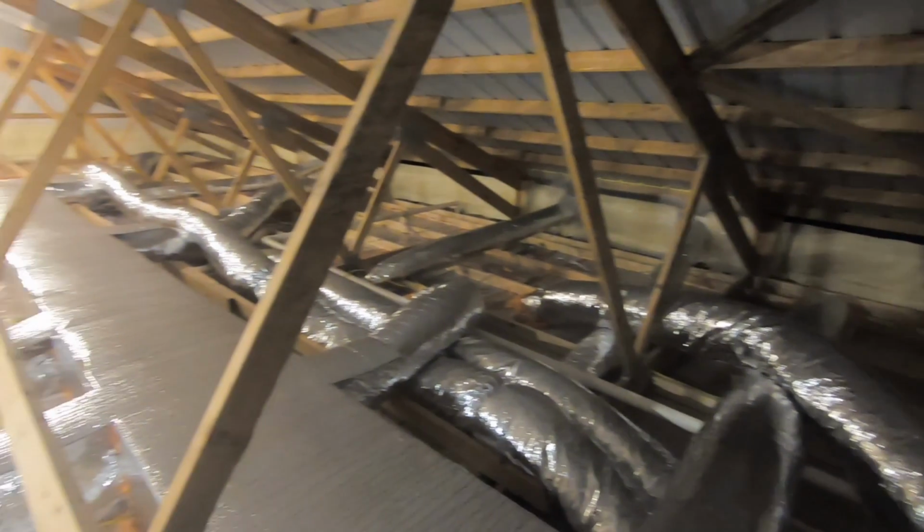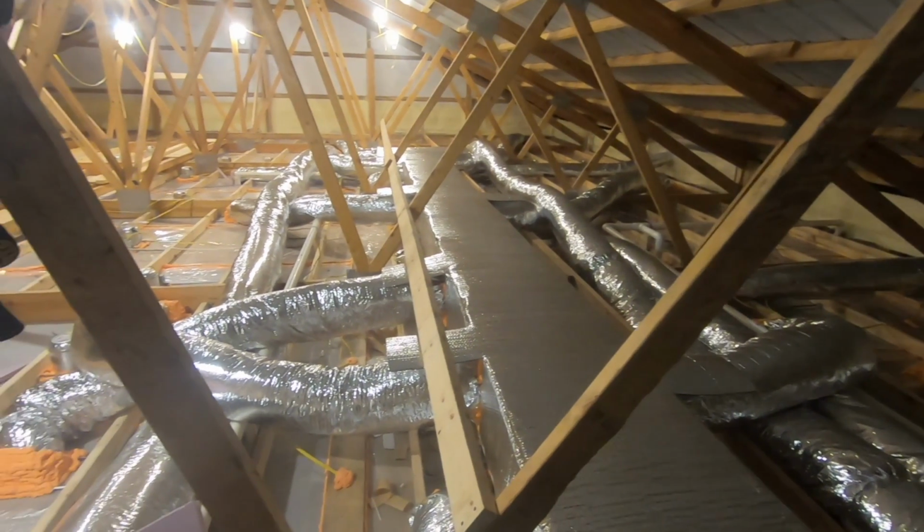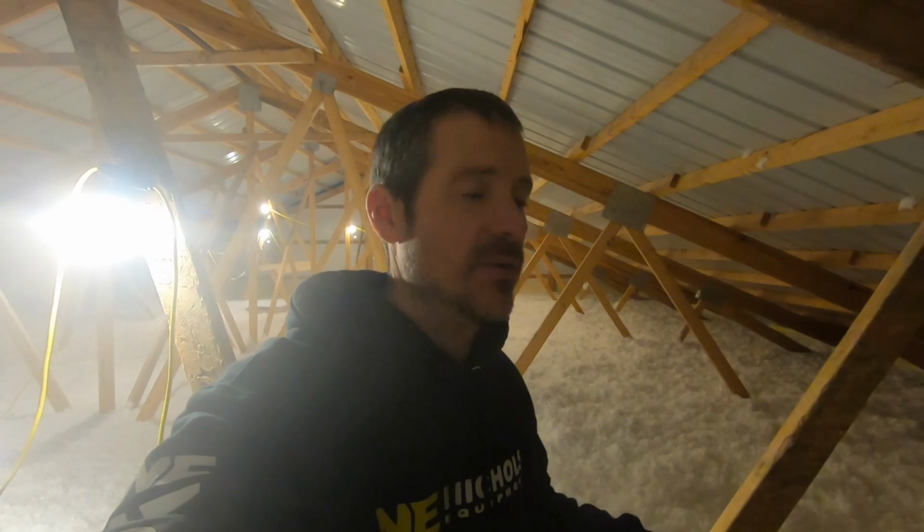I know this wasn't the most exciting video. You can run ductwork successfully in an attic. You just have to make sure that it's done properly. Take your time. It's not something you want to get sloppy with. You want to make sure every inch of that duct is covered with insulation and sealed off from any of the air. And I've done this in one of my previous houses, and I had really good success with it, and the house was pretty efficient.